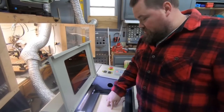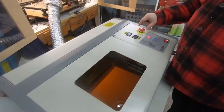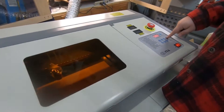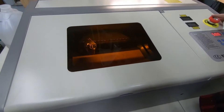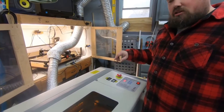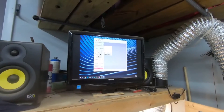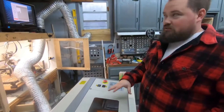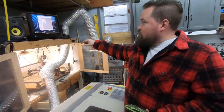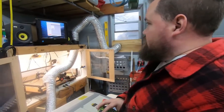Let's go back and do a test hit. We've got a scrap piece in here. The exhaust fan is on — it pulls decent, but we went ahead and fed it into our good exhaust fan. What the machine says to do first is to test the laser by turning it on and then hitting the emergency stop and watching the laser to make sure it goes off immediately. We hit the laser test switch and we get laser. I held the laser test switch button while it's on and then hit the emergency shutoff to make sure it killed the laser immediately — and it did. Now we can get it plugged into the computer and actually test the machine. The dongle that came with it had software on it, but I went with K40 Whisperer. I exported a file out of Lightburn in SVG — just our normal power scale — and I'm going to run raster engrave at 100 millimeters a second. I'm going to keep my hand close to the emergency stop button because I'm not exactly sure what it's going to do.